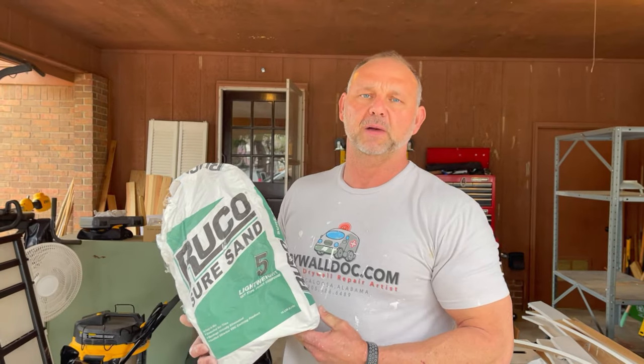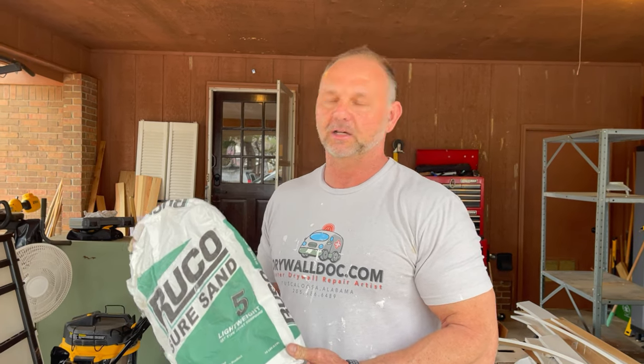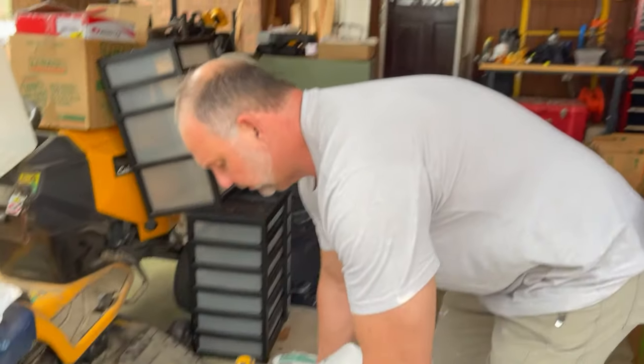But I'm going to show you how to mix it up real quick. I mix it up by hand in a pan. Never try to mix it up in a bucket because it's only 5 minute mud. And I have people sometimes work with us and they'll try to mix a bucket of 5 minute mud up, and by the time you get it beat up with a paddle, it's dry. So we're just gonna mix a pan at a time. But it goes a good ways anyway.